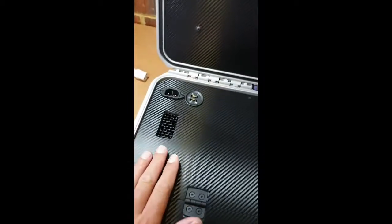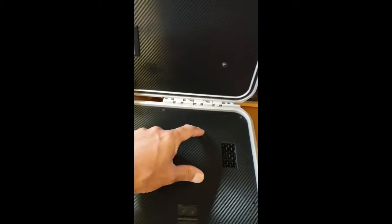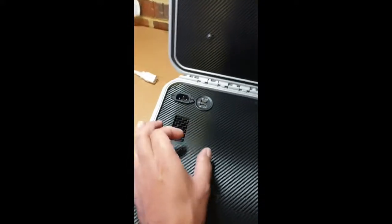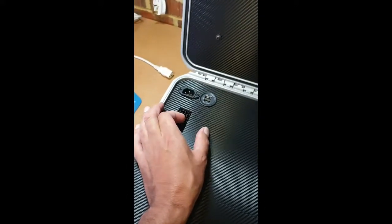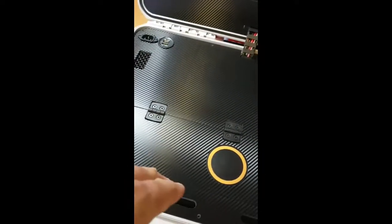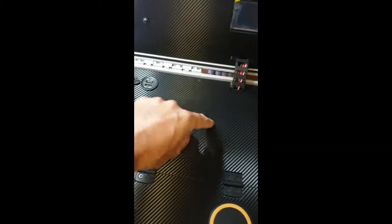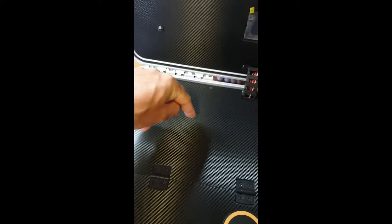The way I've worked it out, you'll see from some of the photos later, you've got one PL6 here, one PL6 on this side with the fan. And the idea with the fans is they are within about an inch of the inbuilt fans on the back of the PL6. So basically the PL6 will take any cooling air that comes into the case here. The PL6 will suck that in from underneath. It will go past its internal heatsink and then get thrown out the back straight into the radial fan.